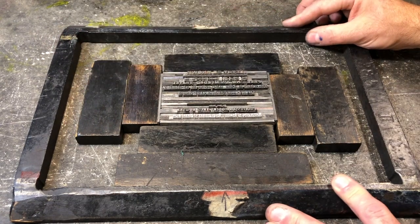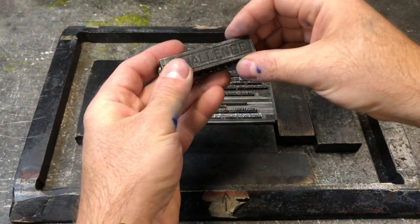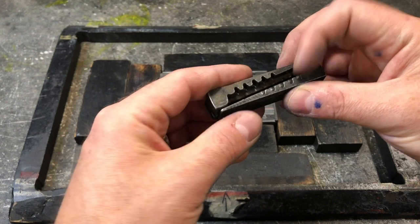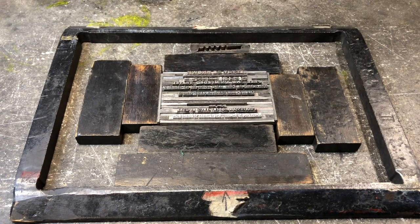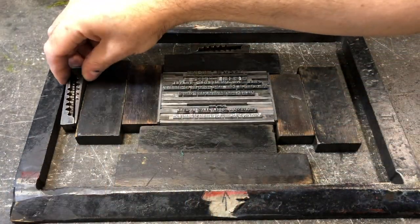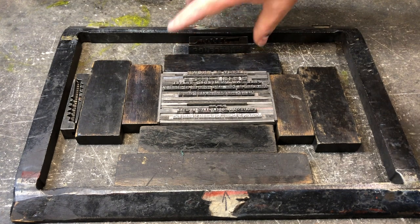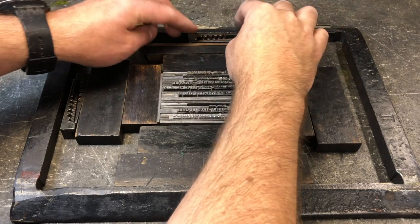As I move towards the inside of the frame itself, moving away from the lead type, I need to leave some space for these things. These things are called quoins — Q-U-O-I-N-S. These little beauties are what allow us to achieve the kind of pressure within the chase that we need to hold the type and the lead and the furniture all in place. In most cases you need quoins on the top and on the side. Typically we don't put metal next to metal, so the quoins will go close to the inside of the chase, but we'll have thin pieces of wood, which we call reglette, to prevent metal from touching metal.